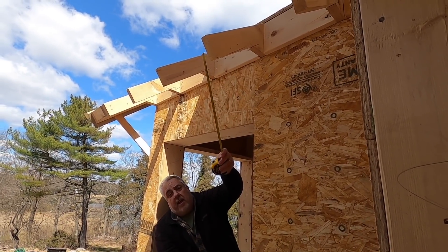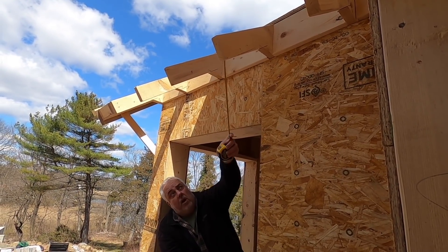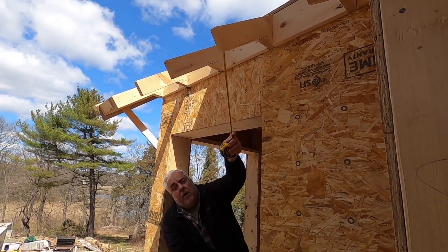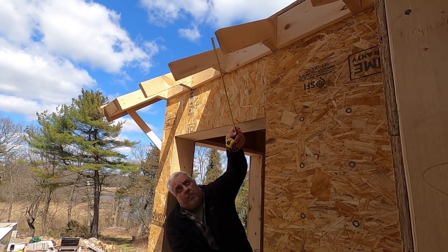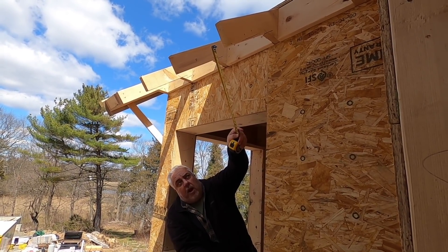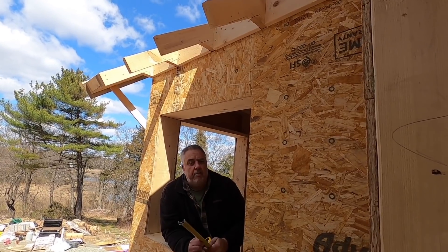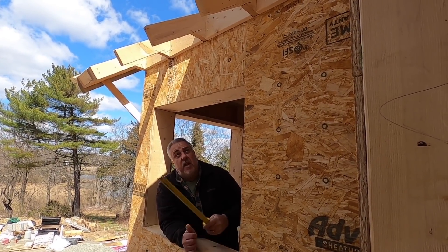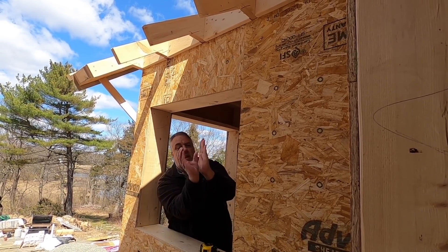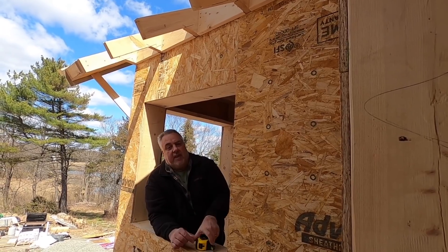At the end of the rafter tail, you have two options. You have what I call the square cut, which is what we have here. Notice that the square cut is actually perpendicular to the slope of the rafter. The other cut is called the plumb cut. A plumb cut is if I attached a string there and it dropped down — it would be a vertical cut on that rafter tail and this piece would extend down. The most common reason for using the plumb cut is if you want to put gutters out here, because then you have a vertical face to attach that gutter to. If you have a sloped face, it makes it a little awkward to make that gutter connection.